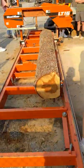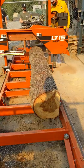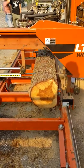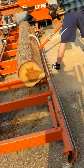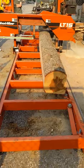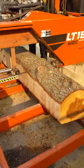Rolling at 90 again, checking it with the level to make sure we're perpendicular to the bed, and cutting our third cant out right here. Now that the third cant is cut, we're going to roll it one more time and cut our fourth cant. These cants are just cut off to give us a big rectangular block of wood before we start slab milling that out.